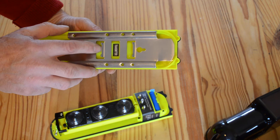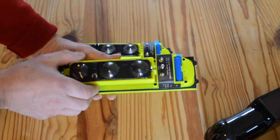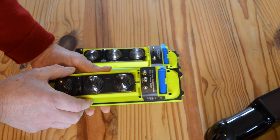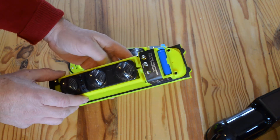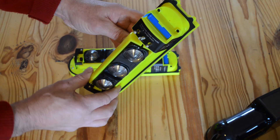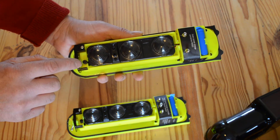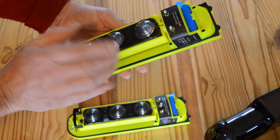What you have here is the transmitter and the receiver. These are the beams that point to and line up with each other, and once they're broken the alarm will go off. These are totally adjustable. If the post or wall isn't quite upright or in line with the other beam, you can twist these to line up with each other. Both beams twist side to side, and there is also a vertical axis adjustment that tips up or tips back to line up.